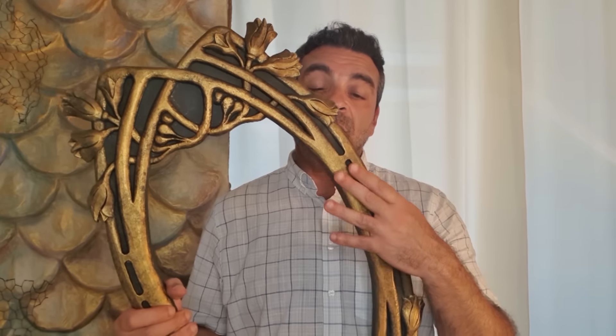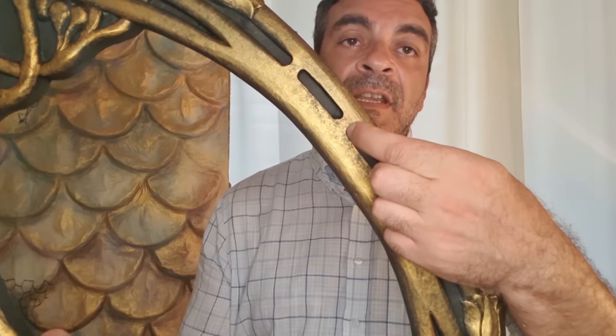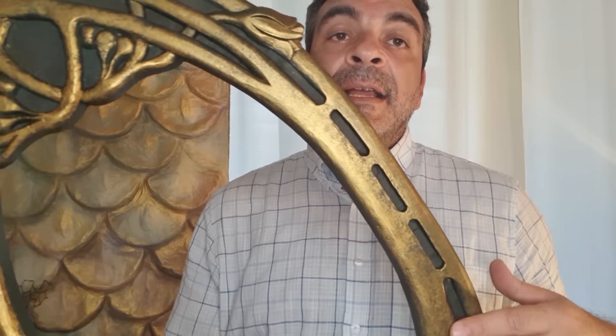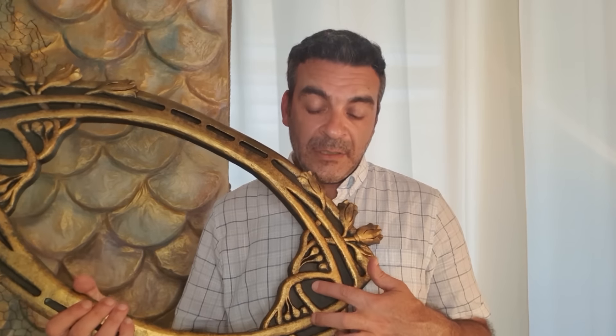So we tried to figure out how this mirror would look in its entire glory. The process: first we did a very good clean because it was very dirty — we had to get inside the nooks with a wet brush and sugar soap. Then we did a very fine sanding, because the paint underneath was water-based so we didn't really need to sand heavily, but we did apply wood filler in some parts. Then we gave it two coats of Black Forest.